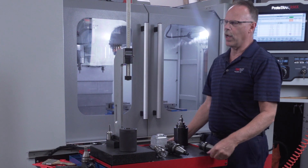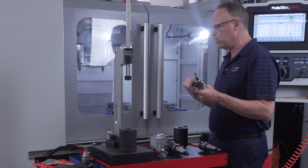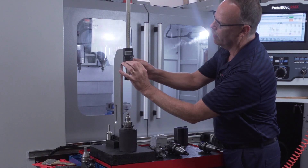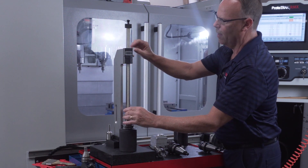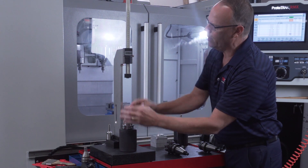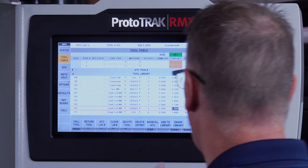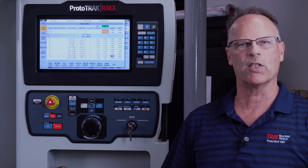When I have the tool setter, it basically has a vernier caliper on it and comes with a tool setting device — I can use it in the machine or in the tool setter. I set my standard in here, turn the scale on, bring it down to the top, and zero it out. Then for each individual tool, I take that specific tool — in this case my three-quarter inch end mill — put it in the same holder, touch it off the top, look at that number, and punch it in. I've already done that for the other tools to save us some time.